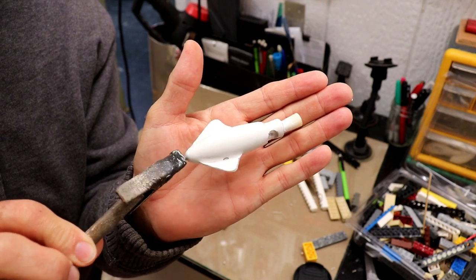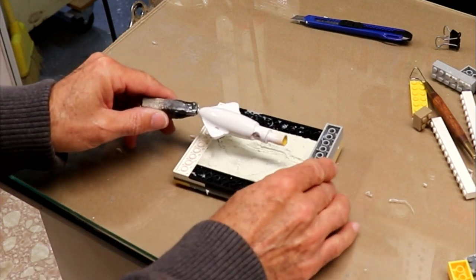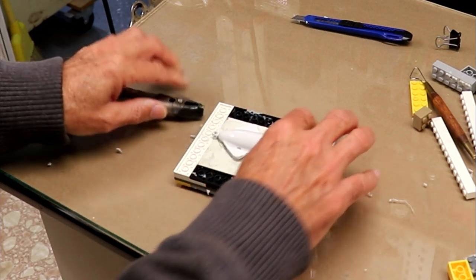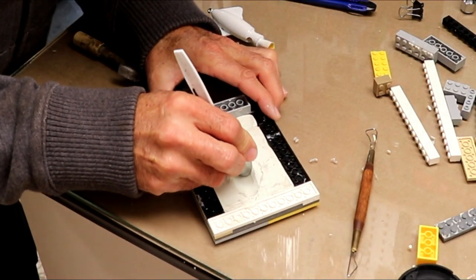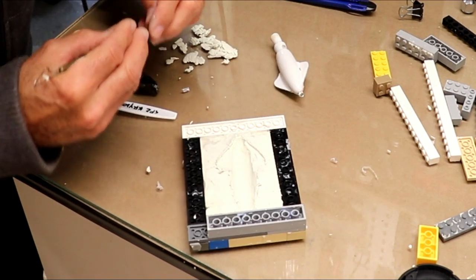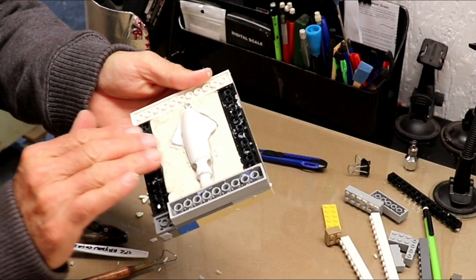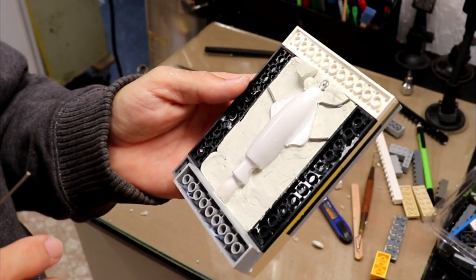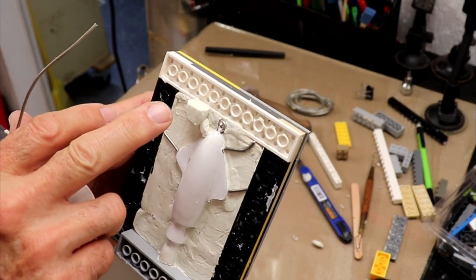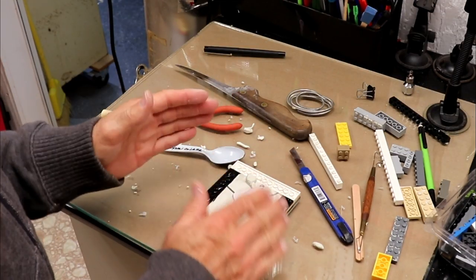I just got it out of the UV chamber and it's set up — the finish isn't perfect but it's plenty good for a soft plastic mold. This thing has to go up against this backstop and get shoved down right along the halfway mark. I want the little wings all the way down in this clay. I always find I have to cut out a lot more clay than I imagined. It's all set now — the bed is laid out nice and smooth, with good connections on the lure. I made a little pouring sprue and little vents out of lead-free solder, and I'm building the walls up high enough to get at least three-eighths of an inch over the body.